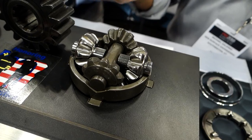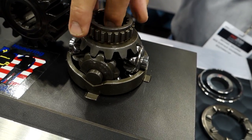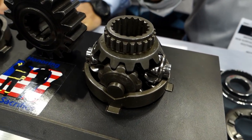Okay. And REM Black was developed for a specific application. It actually looks like a sponge if you were to put this under a microscope. It holds lubrication in there. It's not a hard coating, it's a soft coating. Does it come off then? It will come off, but you'll still have lubrication values there.